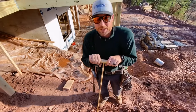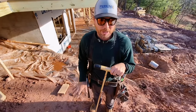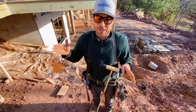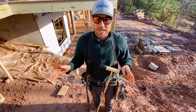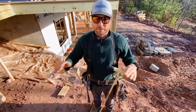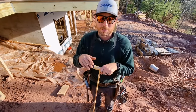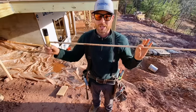I do want to mention one other thing: if you have soil like this — or similar to this that's sandy or soft — you can get an engineer to engineer you a special footing or pier. He will calculate the load and make a bigger or thicker footing so that it will actually support the load, if you have a special situation where this regular test fails.